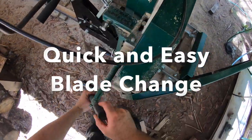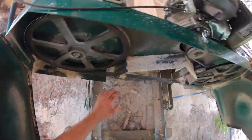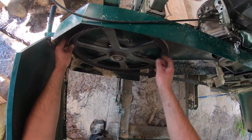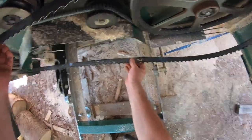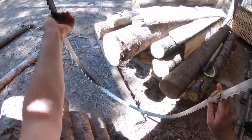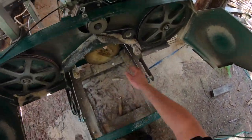Real-time blade change. Let's take the tension off this thing — I'm gonna take it all the way off. As you can see, you get a build-up of sawdust in here. Once the cast iron band wheel is loose, that's what you want. Then you can carefully — preferably with gloves, but I don't have any out here — take this blade right off. I'm gonna get it out of the way, put it up to the shop, and get that sharp. I've got a bit of a pile going so I'll get to that hopefully sooner rather than later.